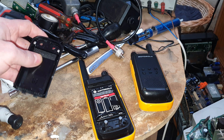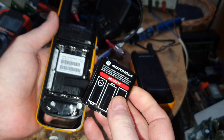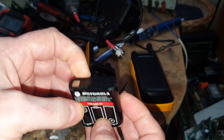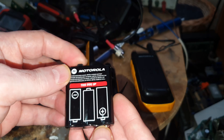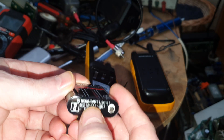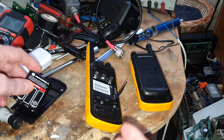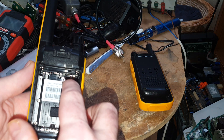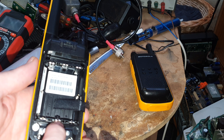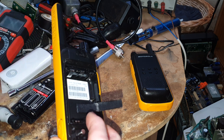And I believe these are still running — yes, look at that, the original Motorola batteries. This is how I figured out the mod for making it charge standard NiCADs and NiMH batteries: when this battery pack is installed, the middle cell is disconnected, and when you put in standard NiCADs or NiMH batteries, the middle cell is connected. So they're detecting a voltage off this pin, and that's what tells it it can recharge — it's not the battery pack.